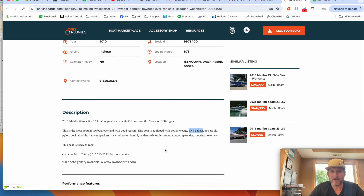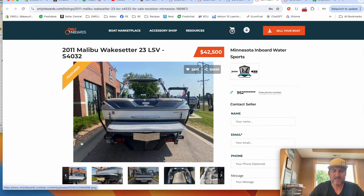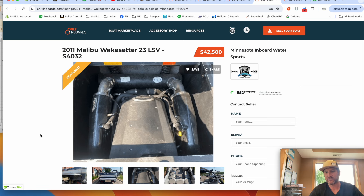The Malibus have a different ballast system. MasterCraft and Nautique in this time frame have reversible pumps — MasterCraft started doing reversible pumps around 2006, Nautique around 2007. Malibus used aerator pumps like a bilge pump: one pump mounted on the through-hull to fill the bags or tanks, and another pump mounted to the tank to drain them. It's a little more complicated and creates more plumbing issues when adding plug-and-play bags, especially since most 2009–2011 boats didn't come stock with plug-and-play hookups.